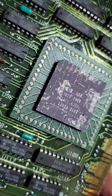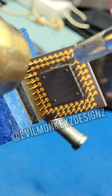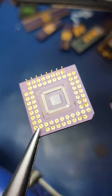This purple ceramic part is inserted into an interposer but pulls right out. These types of parts typically have a ceramic lid on the back that's held in place with adhesive. Heating up the adhesive weakens it and allows the lid to be removed. With the lid removed we can get a good look at the chip inside.